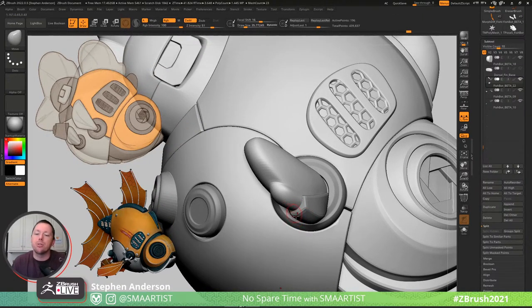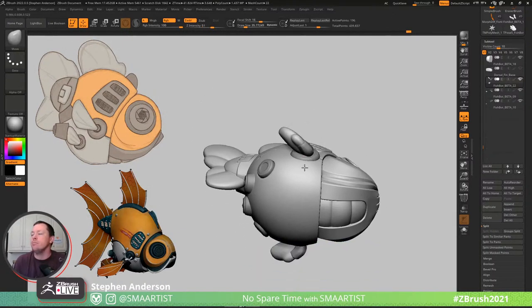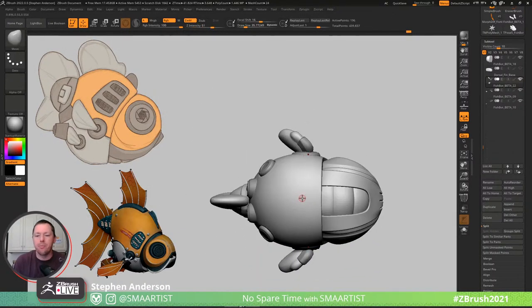Oh, yeah. So the drain hole, I'm actually planning on creating a drainage hole right here in the bottom where I'll be having my sprue anyway. And then I'll have it at the size of some acrylic rod or something like that I can actually just place in there when I'm molding. So that way it's just all taken care of.